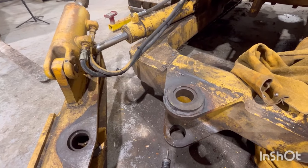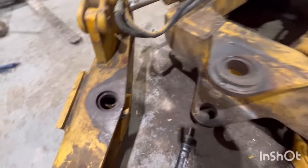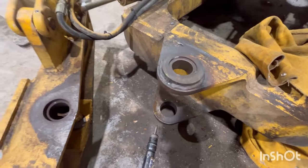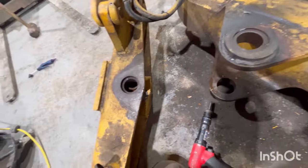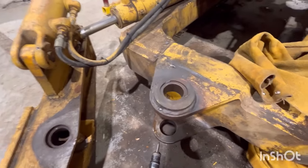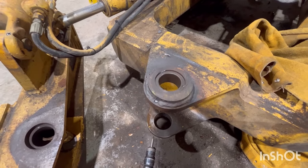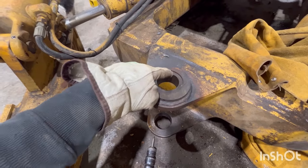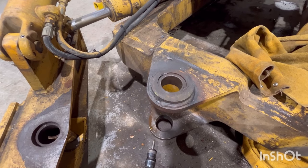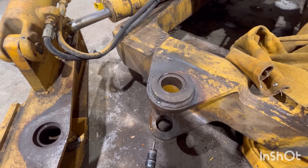Back on the dozer today. Got a bunch of parts in the mail yesterday Saturday morning. It's time to get these old bushings out of here - except for this one of course because it came out with the pin. I got four brand new bushings, they're all stuck. I've kind of rattled on them with the air hammer, but I think I'm going to treat them like a bearing race in a hub - I'm going to weld some passes around the inside. What that does is when it cools, it makes that race contract and then hopefully it'll drive out or fall out of there. We'll give that a try.